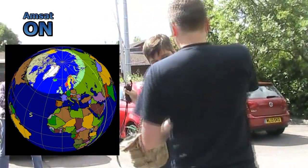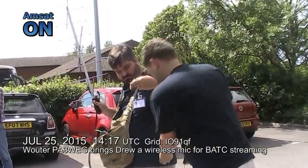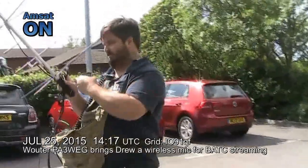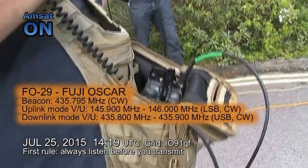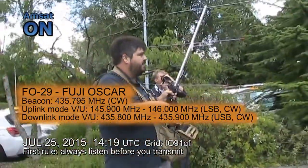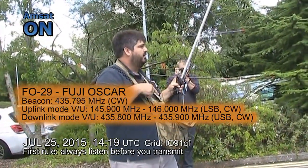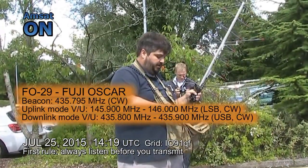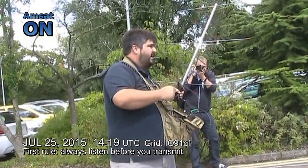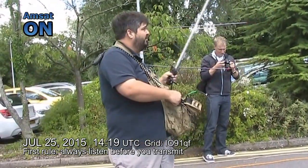Oh, you're kidding me. Regarding interference, that's a little difficult. A headset and VOX helps quite a bit, or using a fixed transmit frequency and figuring out about where you'll be. Call CQ and let somebody answer you and tune to it. That way you're not trying to do more than one thing at once. So I'll try to turn the volume up as loud as I can. When I'm transmitting, I'll turn it down a little bit to keep it from squealing, from feeding back. Or getting run over.